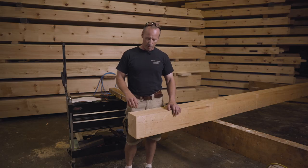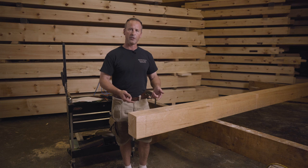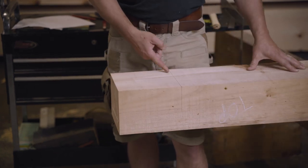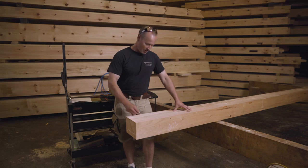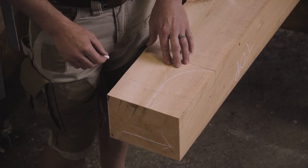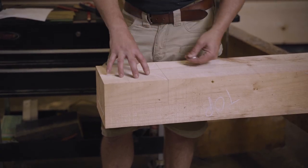I'm going to show you a third technique which involves using a large circular saw. We'll actually cut in along this line, roll the rafter 180 degrees, and cut along the same line on the other side. Then we'll make a third cut across the end. Because the circular saw blade is circular, it's going to leave an odd-shaped piece of wood that we'll need to remove with a hand ripping saw. Finally we'll make a saw cut across and this entire block will come out.